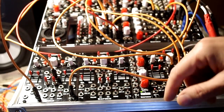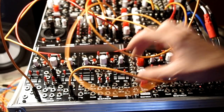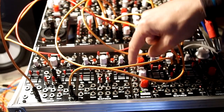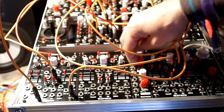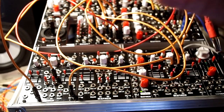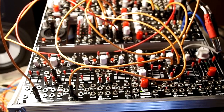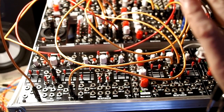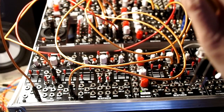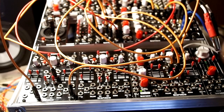If you don't plug anything, channel one is normalized to channel two, so if you don't plug anything on the output of channel one, you have all three inputs from channel one going to channel two. So you can work as a four-channel mixer with two ring modulations in between, which can be very useful. For example, with two VCOs you can have at the same time the mix of these two, and two different ring modulations from different wave shapes.